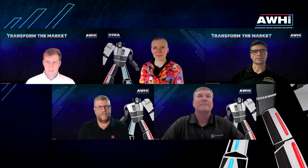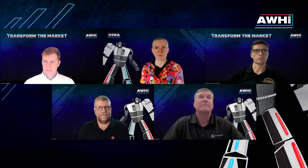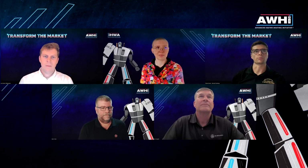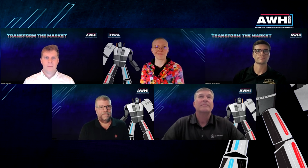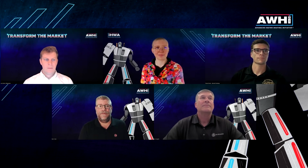Well, if they have an electric resistance, I heard one of the other panelists say this earlier, we would just suggest sticking with the 240 volts since you have the wiring right there. Actually, if a homeowner has an electric water heater, it makes it much easier to sell a heat pump, just because they don't have to do any extra electrical work, no changes to their panel, and they get all the efficiency benefits. So it's actually a great option for homeowners with an electric resistance water heater. Yeah, and because it has 2 methods of recovery, they typically have a higher first hour rating as well. Yeah. The pump and the element will recover at the same time if necessary.